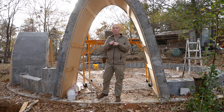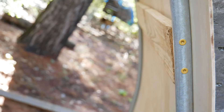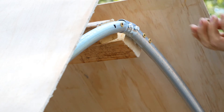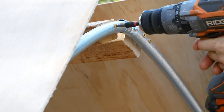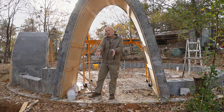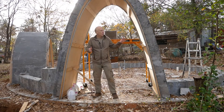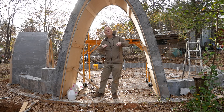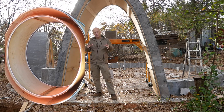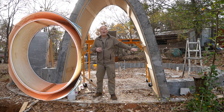You're going to need two complete loops to create a mold. Like the arch-building system, you place 1x4s, pre-drill your holes, and screw them together to create a rigid but circular structure. Then apply utility-grade plywood to the outside of that to create your inside form. For the outside form, you do the exact same process but place the plywood on the interfacing surface of your round mold.